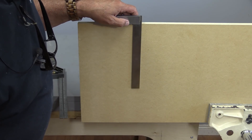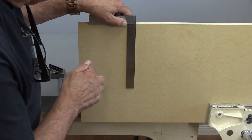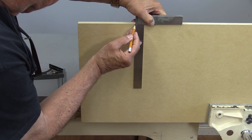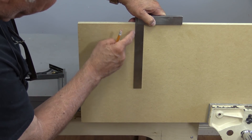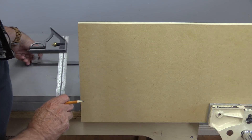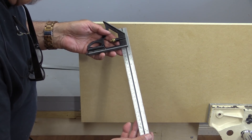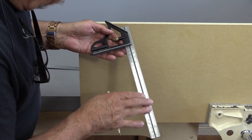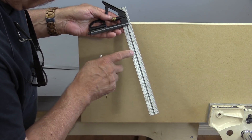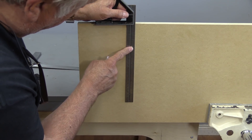Here's a little reminder from Paul on how to check your squares. I have a factory top and I'm using a piece of MDF. I put my square on here and draw a line down. Then I turn it around, put that line at the top, intersect them right there, and draw another line down. At the bottom is what you look at to see how close they align. If you've been watching my channel, you'll know I'm not a big fan of inexpensive combination squares — sometimes they're accurate, sometimes they're not, more often they're not. Unless you start paying up in the $150–$200 price range, then you get accuracy. I found out the hard way that mine is not accurate.